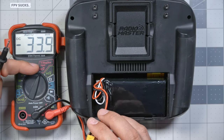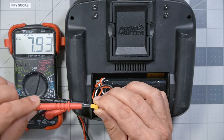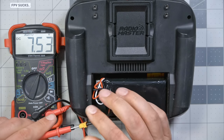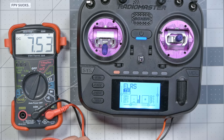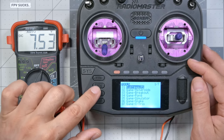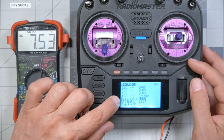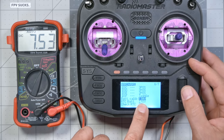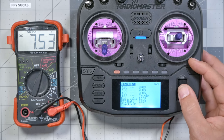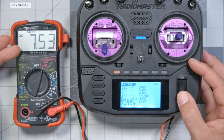We're going to put the multimeter into DC volts mode and plug it into the XT30. The prongs are just the right size to go in with a little friction, and we get a reading of 7.53 volts. The radio is reading 7.6 volts — pretty close to accurate. If yours isn't reading accurately, press the SYS key, page to the hardware screen, scroll down and look for the 'bat calib' option. There you can see even more precision — it was reading 7.58 volts — click it, scroll to adjust the calibration value, and get it as close as possible. 7.52 — there we go, pretty dead on accurate.